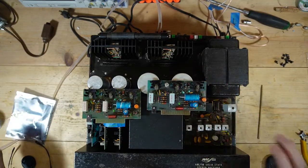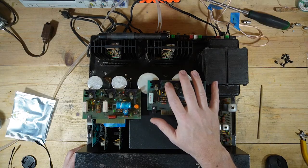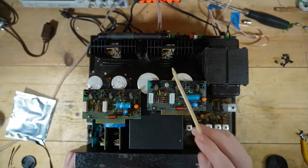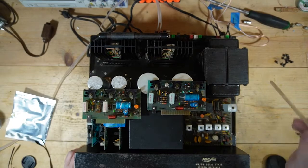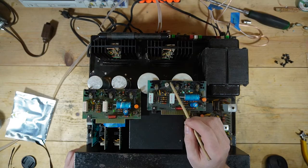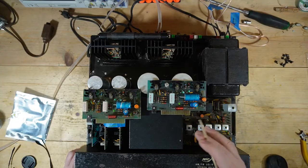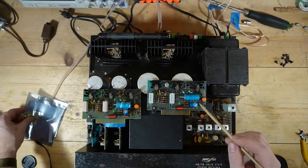And it took me forever to figure out what would work there, because you can't find these germanium transistors. What I did is I had to go to the service manual. The service manual that I have, the part number is 132079. However, you can also use part number 132098. And that was just through a bunch of forum threads that I went through to try to figure out what on earth I could put in that position.